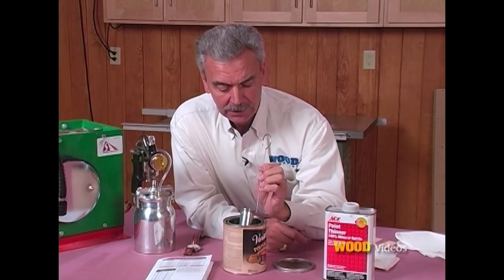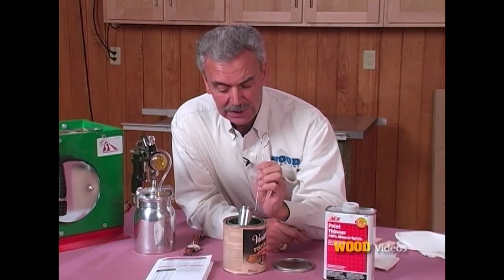One little caution, when doing water-based finishes, if they are a little bit thick, make sure that you remember that you can't thin a water-based finish much more than 10%. It chemically ruins the finish. So most water-based finishes will spray right out of the can. But if you have to thin them, just be real careful with how much water you're adding to that finish.